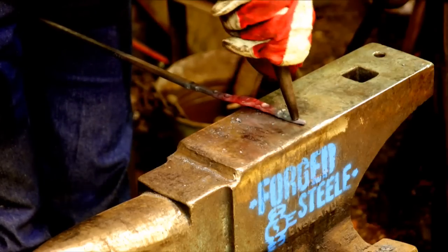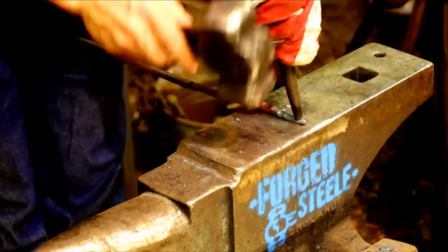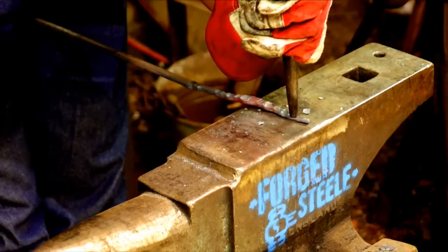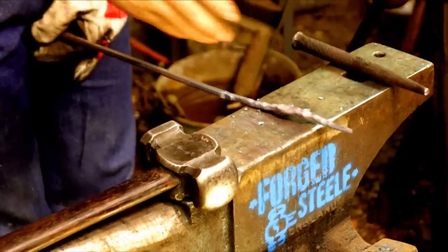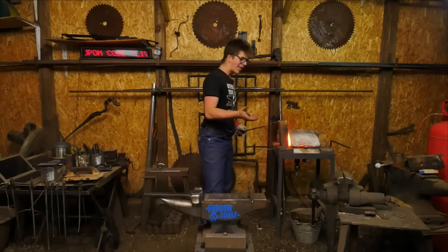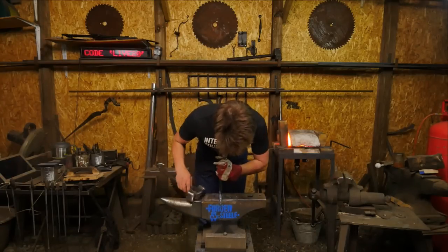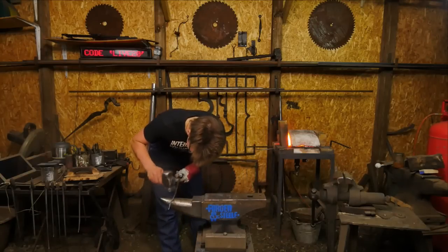Do you heat treat your fullers? With these hand tools, I tend to do a lot of colder temperature work, like this. As a result, I do heat treat most of the hand tools. They get used a decent amount for colder temperature laying out, and it's nice to know that you can do that. For example, here, I want to lay this next one out cold so I don't make another mistake. It's nice to know you can do the laying out procedure without damaging the tools.